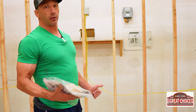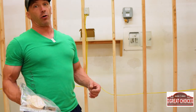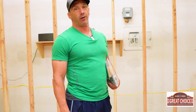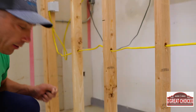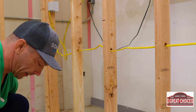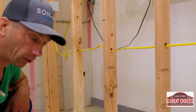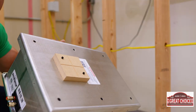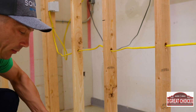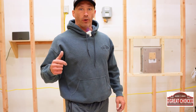We're going to get these speakers going, get the brackets on, and get them installed. We'll start by attaching the block to this hole so nothing gets inside the enclosure while the room is being sheetrocked. We've got a little Allen wrench here and the block is put into place — that's going to protect our hole while the room is being sheetrocked, taped, mudded, textured, and painted.